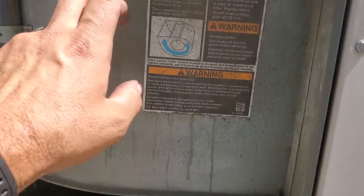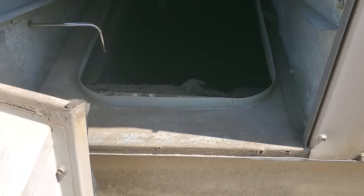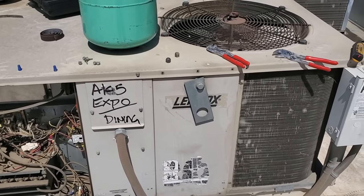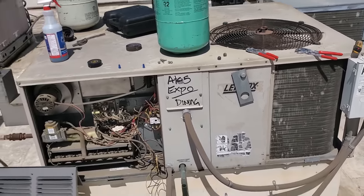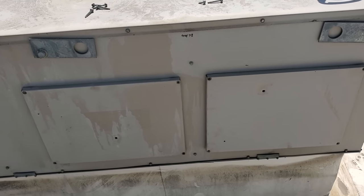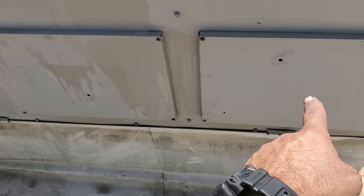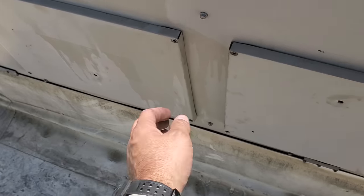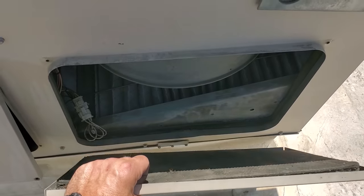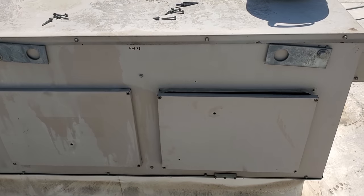This unit has got really low airflow, so I was investigating the blower assembly. It's running in the right direction, I don't see any obstructions in the return. I went downstairs and can feel air pulling at the return - it's just not very much. We're trying to figure out why our airflow is so low. I need to dig into it more, but I need to go ahead and quote this and come back because we're pushing it on this one. There's got to be a damper that I'm missing, but again I can't go any further without their approval. The unit's running - it just turned back on. There's no screws in any one of these panels. When I pull off the return panel, the supply opens up, but there's got to be a restriction or a damper causing the issue. You can see that thing gets sucked in - there's some kind of airflow restriction.